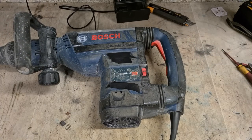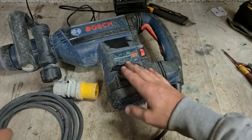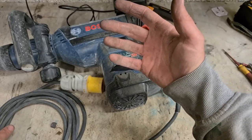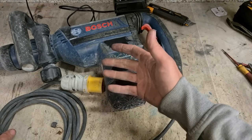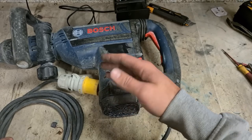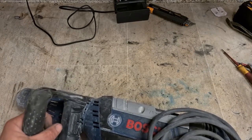All right, that's as much as we can do — still sparking. That could be to do with the new brushes; they still have to bed in a little bit, so you're going to get a little bit of sparking with a new set. Outside of that, it's going to be the armature on its way out. An armature costs about 250 or 300 euro — you're not going to go stacking a new armature into a hammer for somebody who just left it in for a set of brushes. It may be a bad armature, it may be about to fail. May as well give it back to the customer, tell them it's sparking, let them run the machine until it actually packs up — because when it does go, you'll still be replacing the armature anyway. Leave it running, let it keep on running until it does. This could run for a week, this could run for two years — it all depends on how much work the boy's doing with it. Change the brushes, get it running — if the armature fails, then look at changing it then.